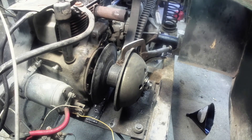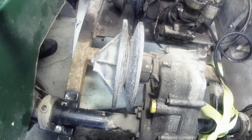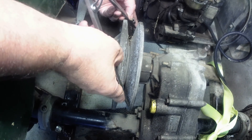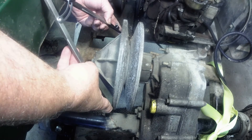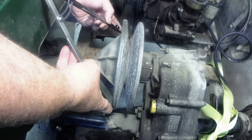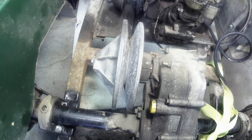I'll move the camera around to get a shot of the back and show you how I'm going to measure that up. Now we're going to measure the back pulley. I'm going to use my dividers — it doesn't matter if you go on the inside or the outside, you just have to make sure you get to the widest part. I'll go on the outside; it's a little easier and I can eyeball across to make sure I'm dead center. I'll lay that on a tape measure, lock it down, and measure it. That pulley is — we're going to call it nine and a half inches.